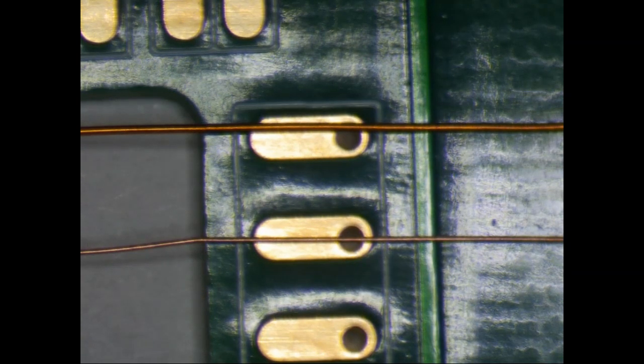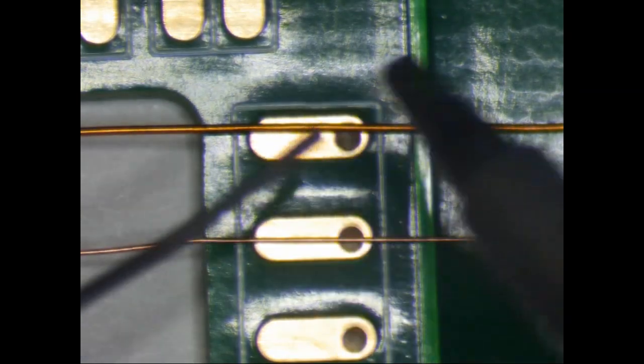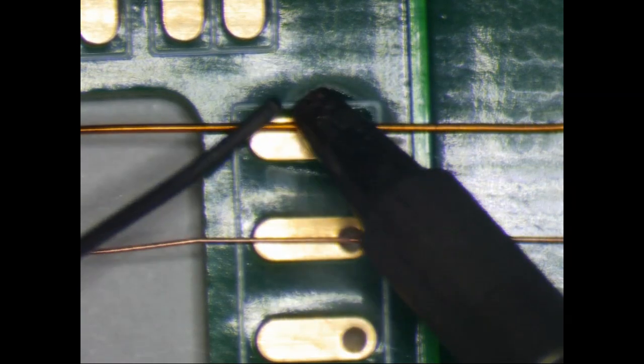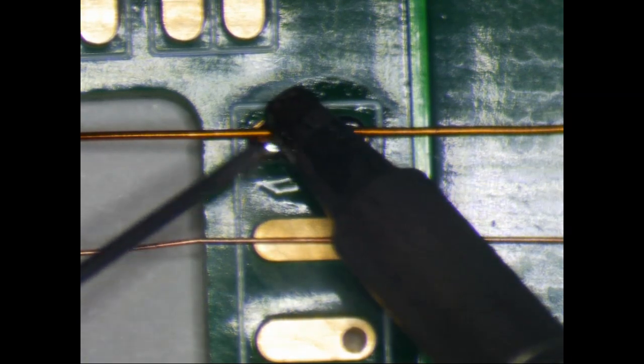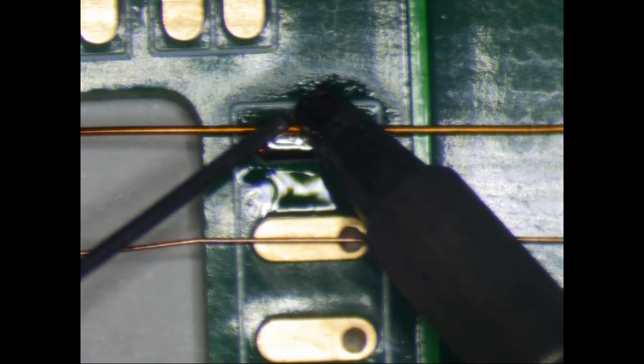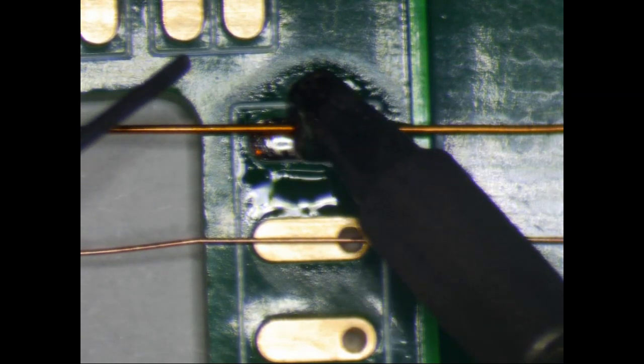So what we've got here are two wires. Ignore the fact they're different thicknesses — that doesn't really play any part. The top wire is a standard enamel type copper wire; the thinner bottom wire is what's referred to as solderable enameled wire. You do need to turn your iron temperature up quite a bit to solder even the solderable type wire. I have this iron set to 395 degrees centigrade, which is quite hot. That's why there's a large wire going through the board — to make sure the pads don't lift off, because it's the wire we want to heat up, not the pad. As you can see, the standard wire doesn't solder at all — you can keep the iron on there for as long as you want and it just will not solder.